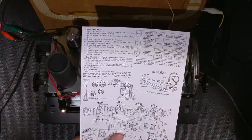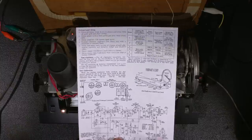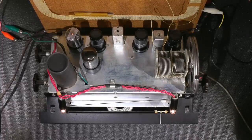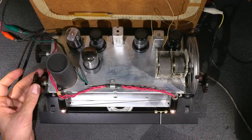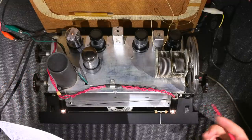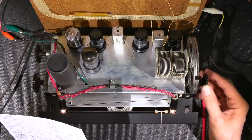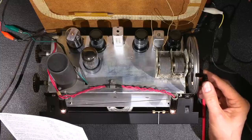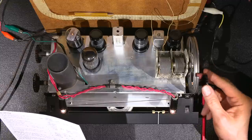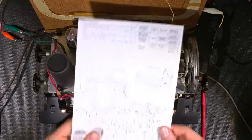And I need to make sure that my signal generator is at 1620 kilocycles, or 1.620 megahertz, if you want to shorten that up a little bit. So that's already set. So all I need to do is turn up the volume. And now I need to find that signal because it's not there right now. So what I need to do is move this around. The signal's there, and it's supposed to be right about there. So that's right on top of that line.